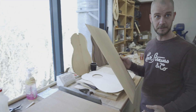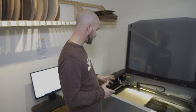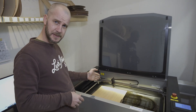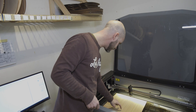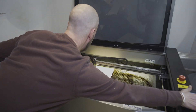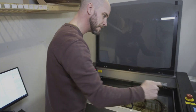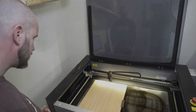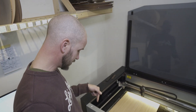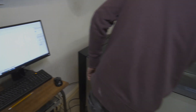So we'll whack it in — 90 seconds later we'll have a back. We've got the back placed in the laser, positioned as we need it, which means perfectly centred. We centre our laser cut from the middle line on this back. We go in the middle of the top, and then we bring the head down to the bottom, so we're absolutely sure we've got it in the middle — because we don't want the line on the back of the guitar to be anything other than bang in the middle, perpendicular to the top plane. With that set and ready to go, I'm going to shut the lid, hit the button, and turn the extractor on as well because we have to extract all the heat.